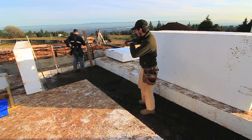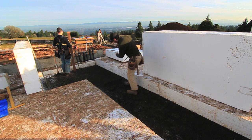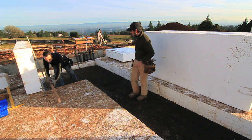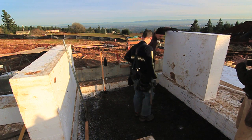After he shoots this in, we'll go through and compact it one more time, and we'll start setting our sheets in. You can see how the sheets can just align the whole way across, then we stagger the joints as we run them back, and then we'll fill in the last piece — then comes our vapor barrier after that. The guys are just about to set our 12-inch EPS.